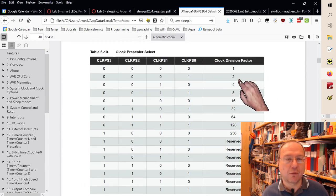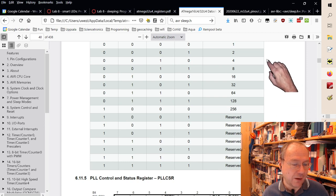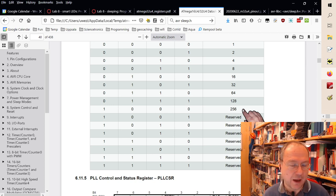And many other modern microcontrollers allow you to do the same thing. Many modern processors allow you to do the same thing, and not only in steps of a factor of 2, but you might know that most processors, most PC processors, Intel, AMD, and ARM, or whatever you have in your Intel Atom, I don't know what else is around, Qualcomm processors in PCs and mobile phones, they can dynamically change the clock frequency on a very fine scale, actually, to 2.5, 2.8, 3 gigahertz. And so this is a bit more brutal, but then on the other hand, we have a microcontroller here, not a PC.